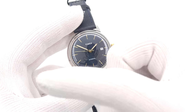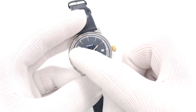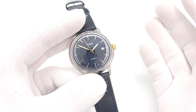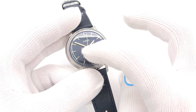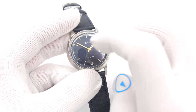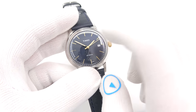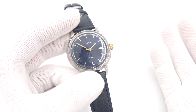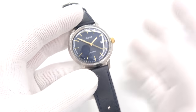Something that came up in that video — a lot of people said, Mark, if the seconds hand pauses on the Miyota stutter and you tell me the timing doesn't change, that doesn't sound right. Why is that? The reason is because of the indirect drive nature of the seconds hand. The seconds hand is kind of dumb — one revolution of the seconds hand doesn't have to equal one turning of the minute hand. The minute hand is directly driven by the movement; the seconds hand is not. They are not geared to each other directly — indirect drive. So that's about it.